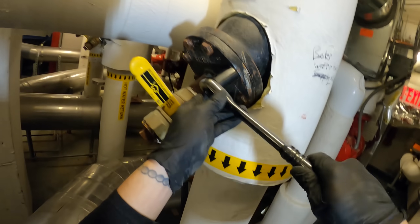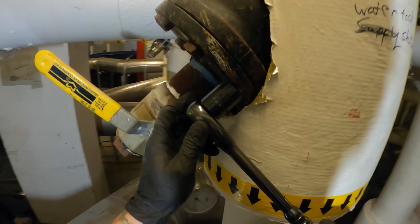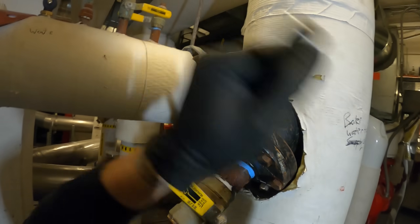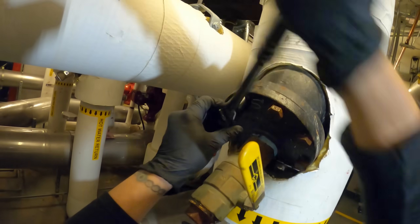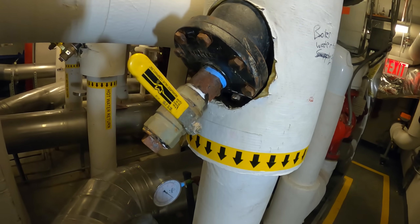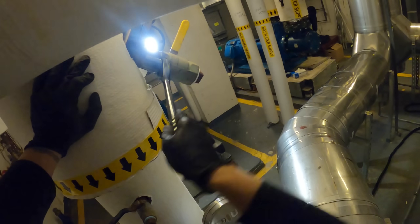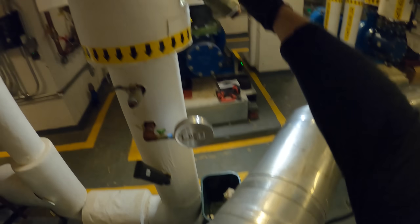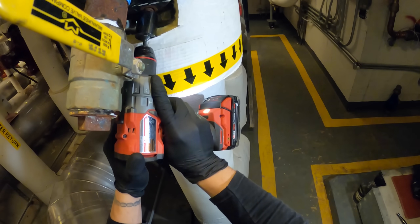We're going to crack it first, make sure this water really stops and that we're safe. Makes you wonder if anybody ever pulled those with that thing open like that — or they just drained it a different way. Let's loosen these up, crack it open, let's get to these strainers. Some of these were so hard to get off — they're so rusted. Another good thing: before we put it back, maybe use a little wheel to get the rust off the threads and put some anti-seize on there. These things are rusted. They're all loose now, so I can use the drill.